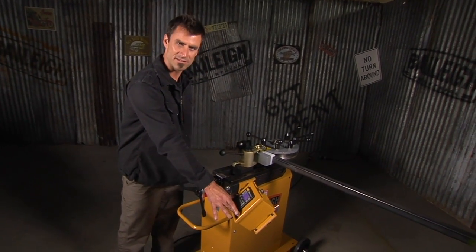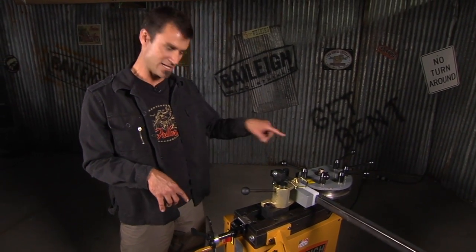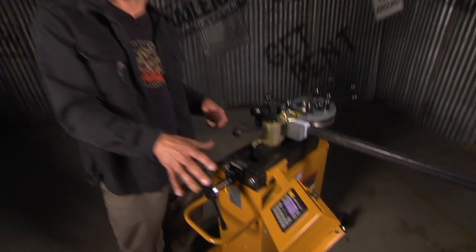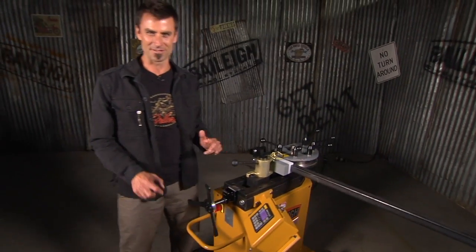Now, you've got a really easy keypad to use here. You can set your angles. There are six different speeds you can set because it's got a gear-driven motor — it's not hydraulic, the way most of them have been. And you can hold 175 jobs, no matter whether it's grandma's porch, or whether you're building a Bonneville car, or whether you're doing a Baja 1000 trophy truck.